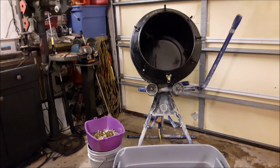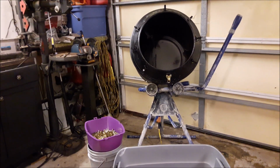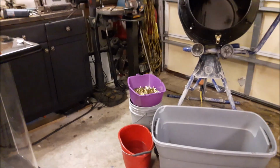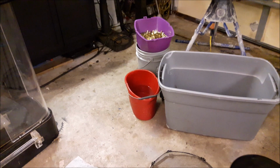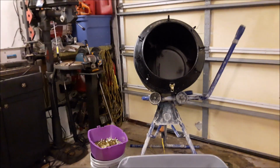In my personal experience, I have found that 1 hour is the perfect running time for an average load of around 500 to 1,000 brass casings. My testing was done with 44 mag, 45 auto, 38 special, and 357 magnum, which is what I'm going to be demonstrating in this video. I have a box over there with 500 357 magnum cases, and I have approximately 1.5 gallons of hot water ready to go.